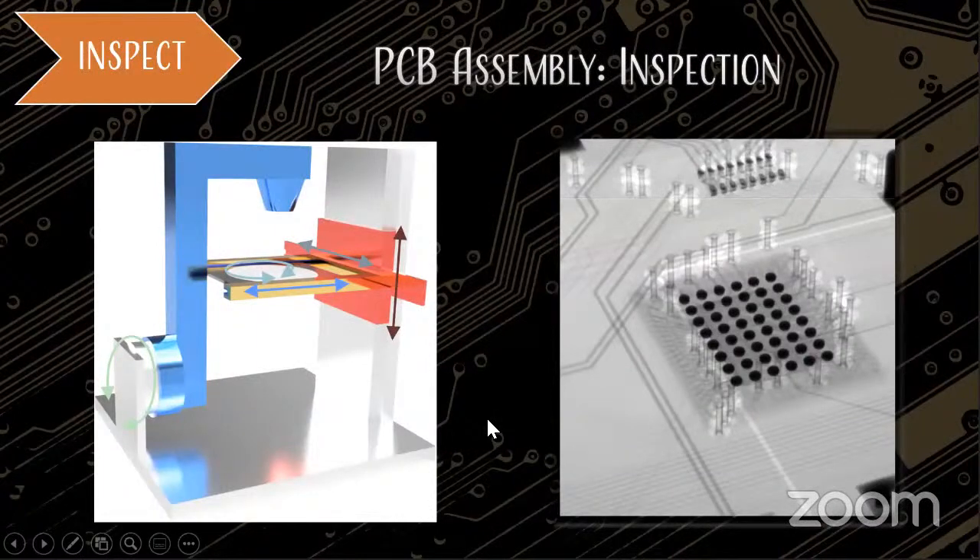After cleaning, we inspect your boards. We have microscopes, optical inspection, automatic optical inspection (AOI), and a cool five-axis X-ray machine. Five-axis means five degrees of freedom — up, down, left, right, in, out, rotate, pitch, and yaw — allowing really cool oblique views of your boards. One problem with BGAs is head-in-pillow defects or solder wicking down into holes, which you cannot see optically. So you must have X-ray inspection. We have an X-ray machine on site and just bought another one for another facility.